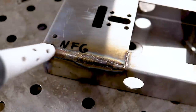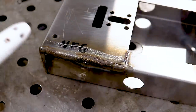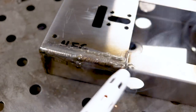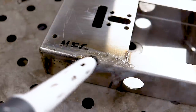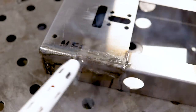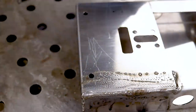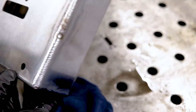Even if you have something that's super over-oxidized — and we may have cooked out some of the chromium and other anti-corrosive properties in the stainless surface — we should still be able to clean it up pretty nicely with the TBE 700. It is going to take a little bit more to get it done. Make sure you keep your brush wet so you don't leave any residual burn marks — just dip it as needed. We can swipe right over the heat-affected zone and clean that up too, getting a really nice finish without any repolishing, regrinding, or refinishing.